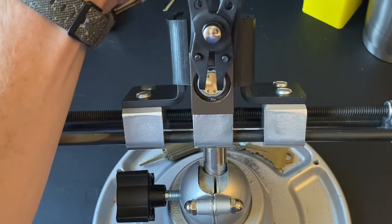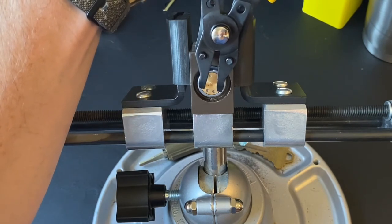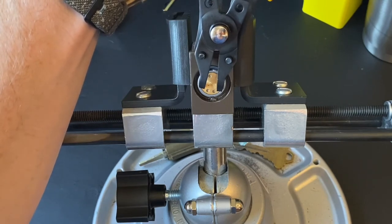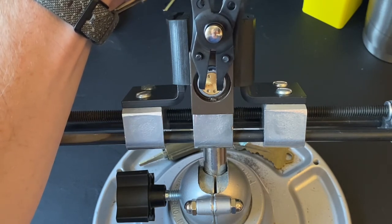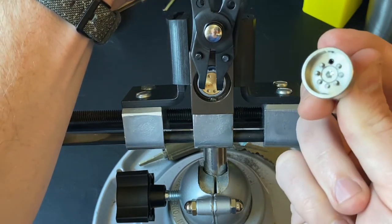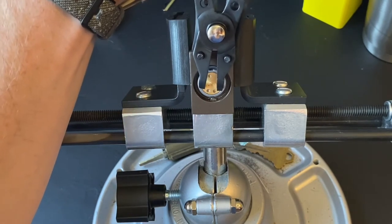So you can see now I'm rotating the lock. So it is picked. If I rotate it too far past about there, it will relock. But all the pins will be over into the next chamber. The drivers and the key pins will match up, and then my key actually won't work because I won't be able to get it onto the lock because of the limiters and where the pins are. So I'm not going to turn it, but I will turn it back, and you're going to hear and see everything pop back up. So let's do that.